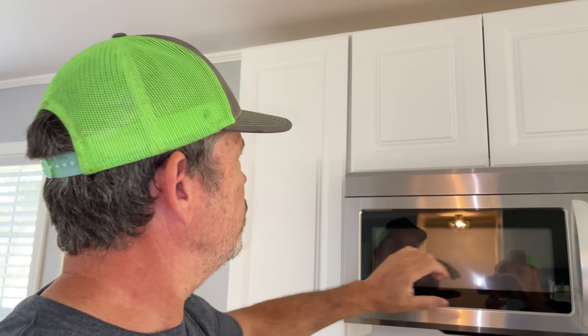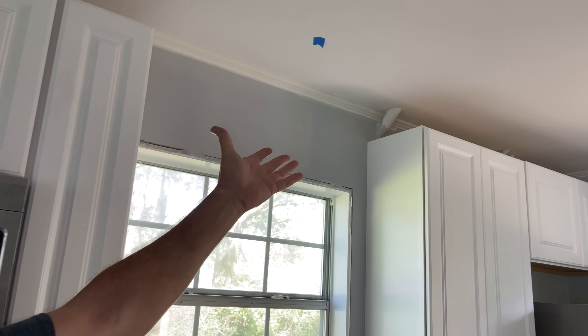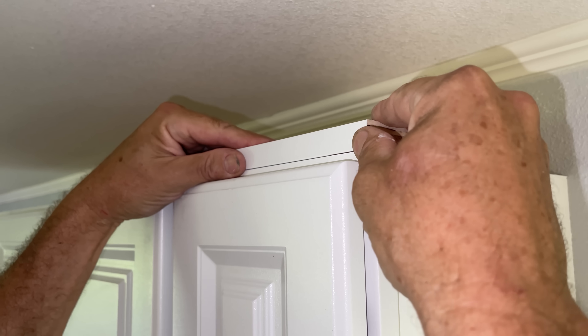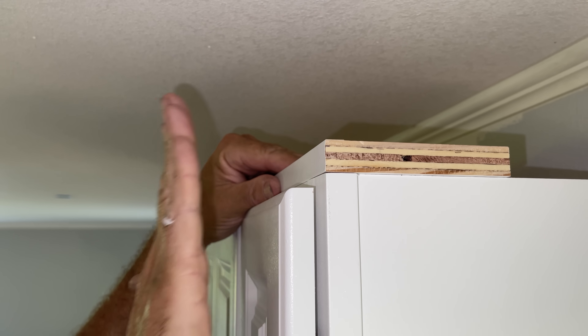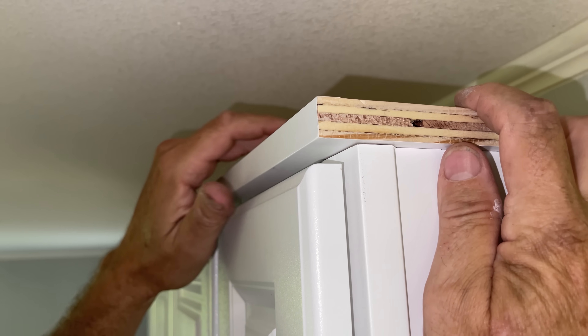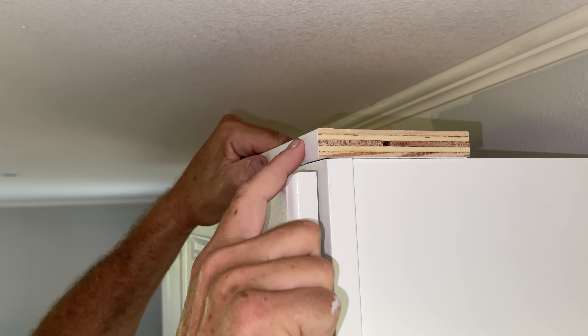The beauty of that is it's modular. If we ever have to get up there — say we wanted to put some LED uplighting on top of the cabinets, or put glass doors with some downlighting, or we've got these funky pipes up there — heaven forbid one of those ever breaks, the plumber can easily get to them by us just taking out our crown molding. It'd be very easy. So the first thing we've got to do is figure out our reveal. That's the distance your nailer is going to be hanging out past your face frame. Right now I have a zero reveal — it is flush with the face frame. So we can go flush, or we can bring it out anywhere we want to. I think what we want is three sixteenths from the edge of this face frame to the edge of the nailer.